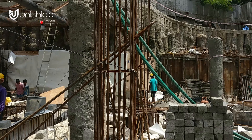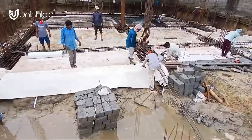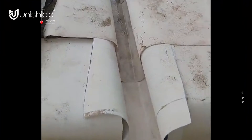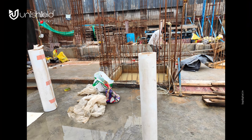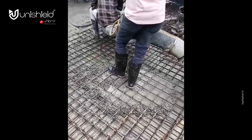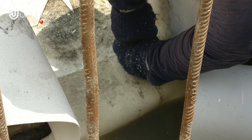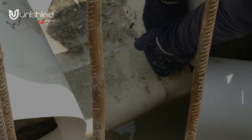Laying: place the membrane made of high-density polyethylene HDPE on the substrate with the particulate layer side up, facing the concrete. Rolls are loosely laid. Unlike conventional membranes, HDPE membrane forms a bond with the wet concrete poured over it and becomes a monolithic part of the structure, which prevents water ingress tracking between the unbonded membrane and structure. Ensure a continuous bond is achieved without creases, and roll firmly with a heavy roller.